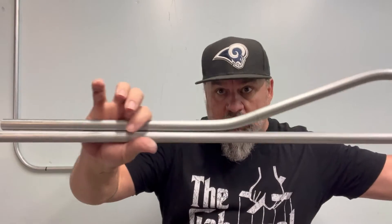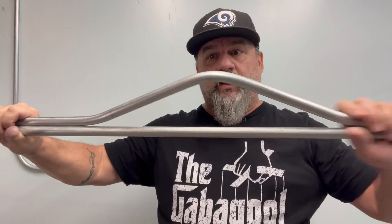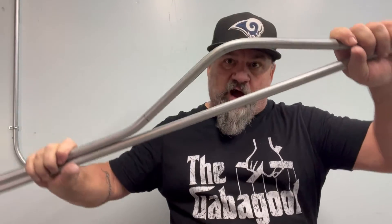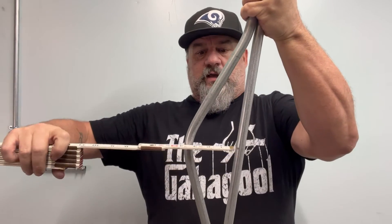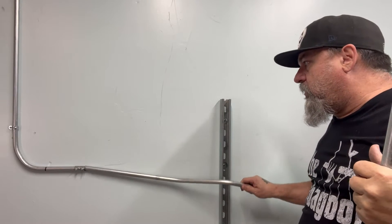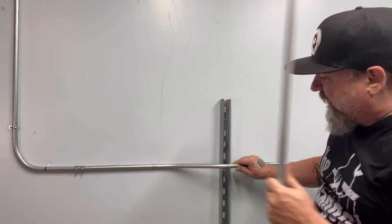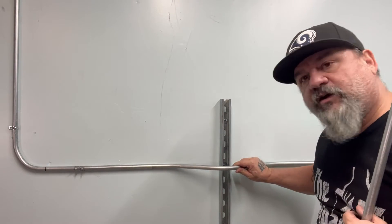Next, we find a straight edge to see if we're right on the money. It's pretty good. EMT has a little forgiveness to it, so if you had to bend it out a little bit if you're a little off, no big deal. Let me get out my stick ruler and see how we're looking — three inches on the money. So there you have the three-point saddle. We landed dead center. We added our shrinkage, that's why we ended up dead center of that.